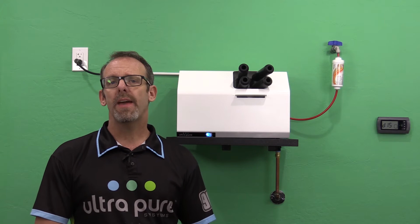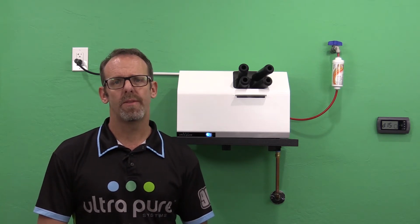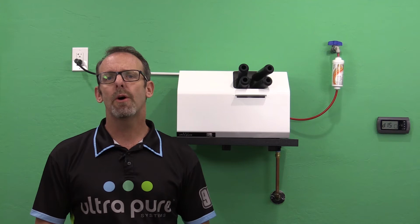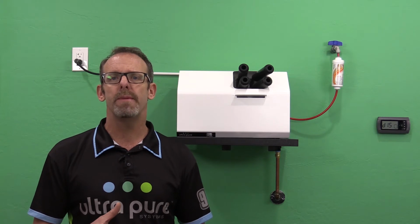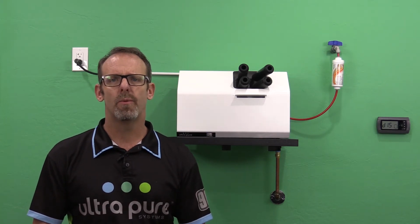It could be a fan problem, that we're not able to deliver the mist out of the basin of the humidifier, and because of that, it throws off the level of the water in the humidifier. It could also be a transducer problem, that we have some transducers that are not firing at a rate that it's making the mist to deliver, and that can also increase the water level.